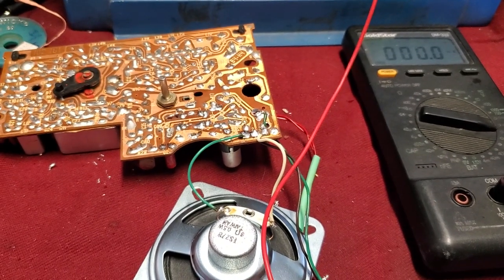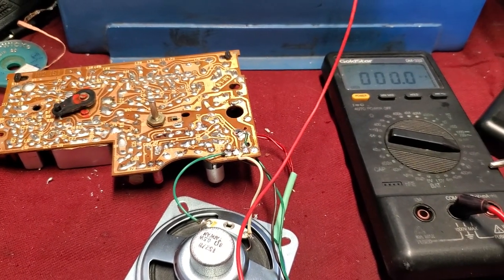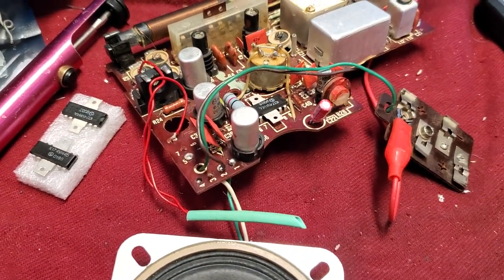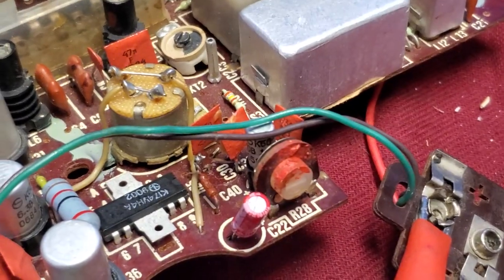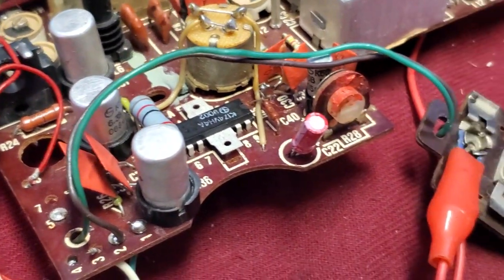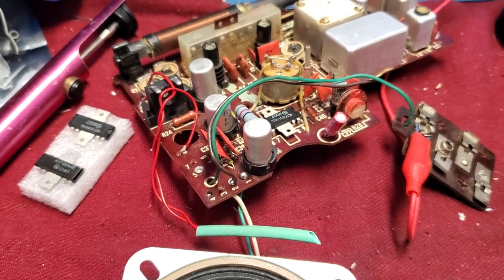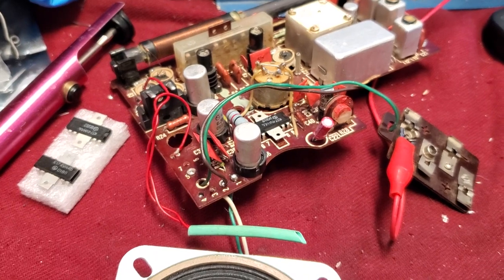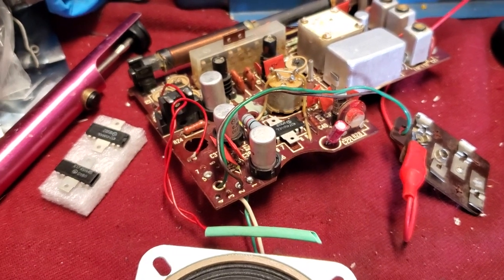Man, I don't know. Let me think about that for a minute. That does not seem right. Something's wrong there. I'm a little bit stumped on this. I changed the IC again. I removed the electrolytics. I also removed these little red capacitors, these little square things. I know these will turn into resistors. And I'm still getting the high current draw, so I'm a bit stumped. Maybe I need to try and find another circuit that uses this IC and figure out some similarities, because it just can't idle at 150 milliamps. That's just not happy.